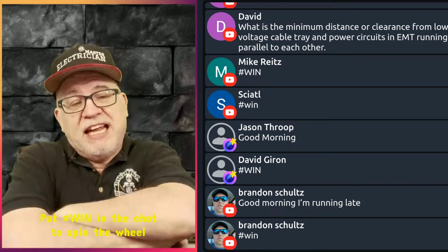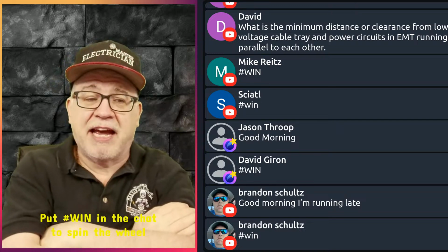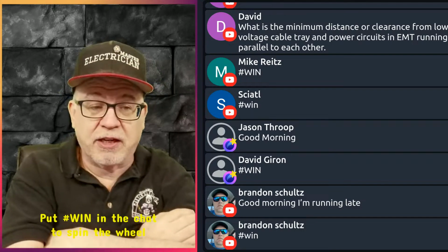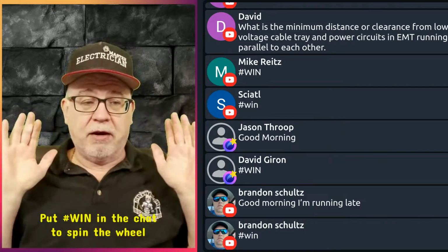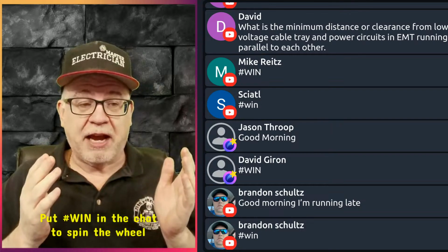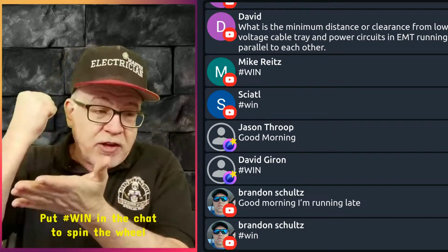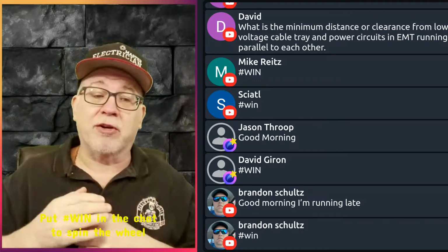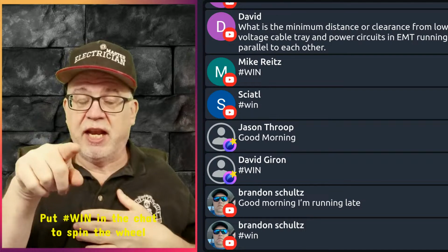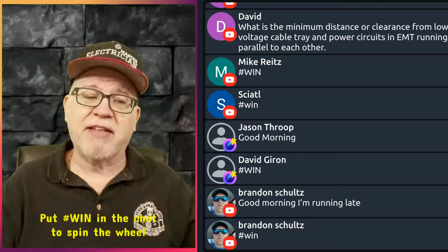So what this means is, an engineer under engineering supervision can come up with an ampacity value for these conductors that may be higher than what's given in Table 310.16 for the conductor, and it doesn't matter to the manufacturers of the wire. We like to follow 310.16, but if an engineer wants to use a Neher-McGrath type of calculation, the informative Annex B values, and they're willing to put their stamp on it, we're okay with it because they're the ones that will be responsible. If something happens, the installation melts down, something fails, the manufacturer's going to go, you did it, I didn't do it. We recommend you follow 310.16. But as an engineer, you do have that prerogative.